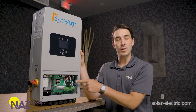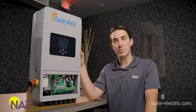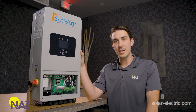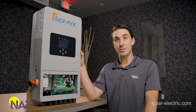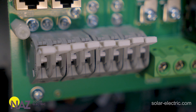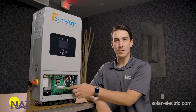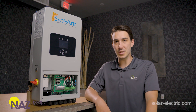One important thing to note is that this unit does not have the built-in 12-volt DC power supply for rapid shutdown transmitters, nor does it have the auxiliary terminals for the rapid shutdown stop switch or initiator. Right below that, we can see the PV terminals. The 5K has two independent MPPTs built in, and just like on the other models, they give you two sets of terminals for each tracker — two positives and two negatives for each of the two MPPTs.